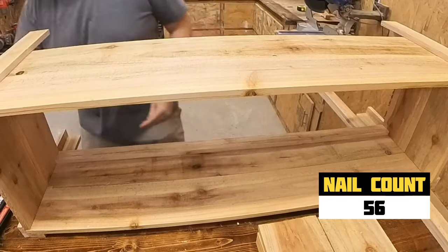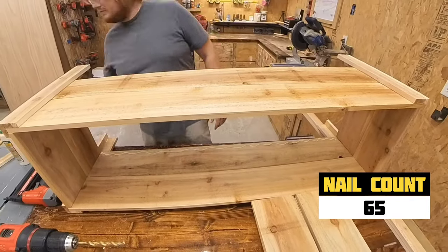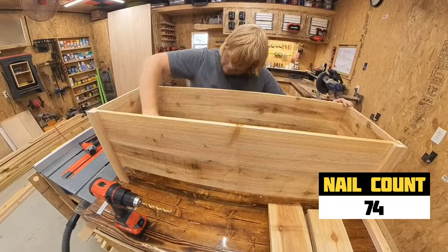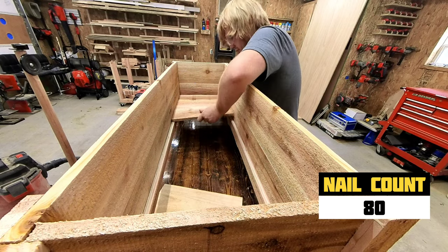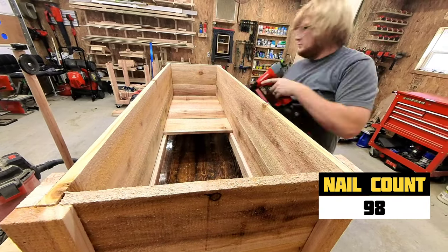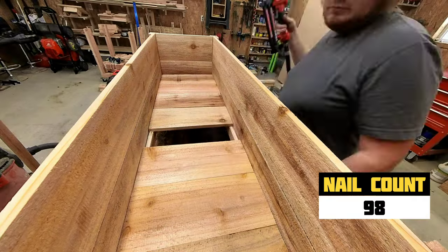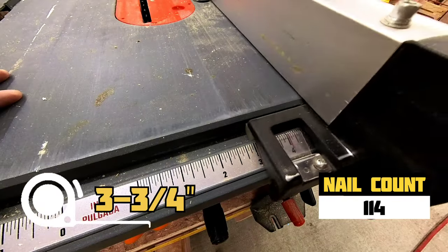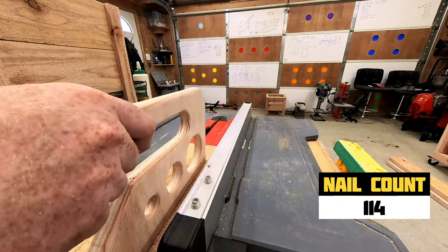Apply some glue to the face of the ledger board and fire in some nails. Repeat for the other side. Rotate the planter box and apply glue to the top of the ledger board — each bottom board gets three nails on each side. Cupped pickets affect the box dimensions quite a bit. I like to align a few boards before nailing them in place, which also allows me to squeeze the two longer side walls together so that the bottom boards are snug. This box has an unsatisfyingly even number of pickets for the bottom, so the board we need to rip down is not perfectly in the center. Measure the final board, rip it down to size, and nail it in place.